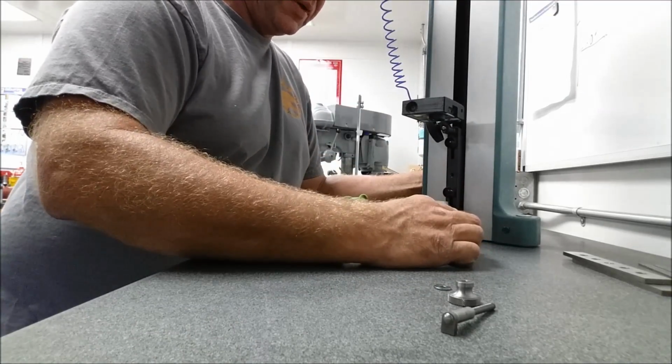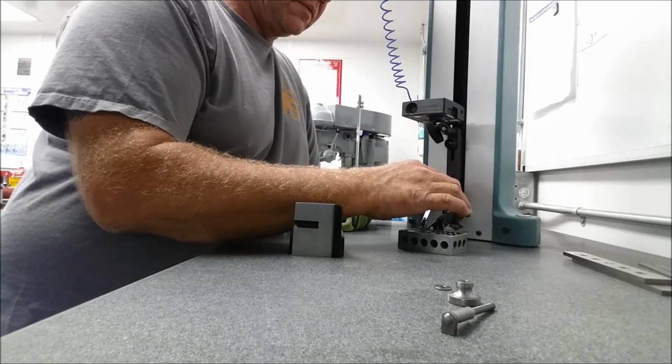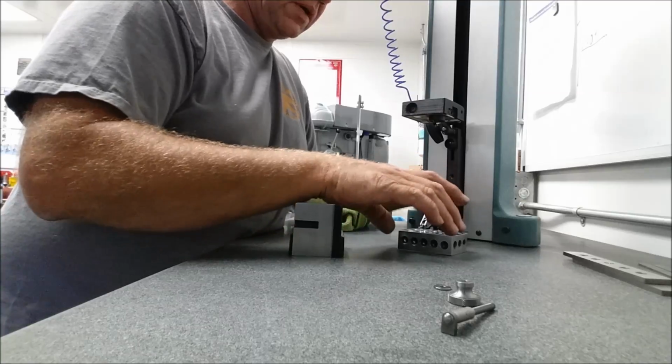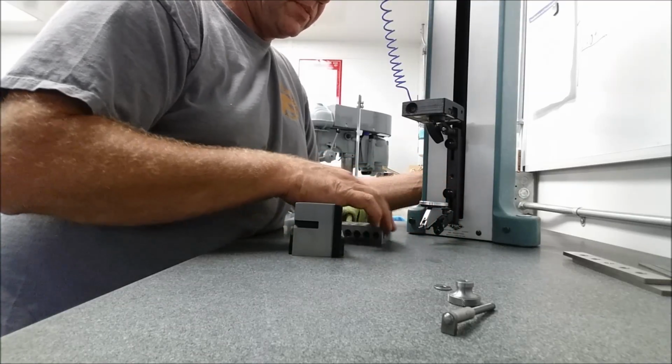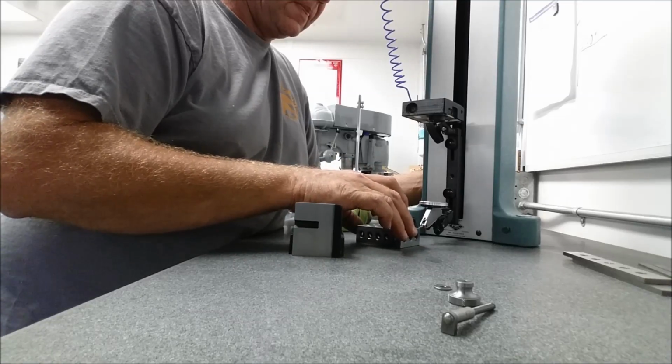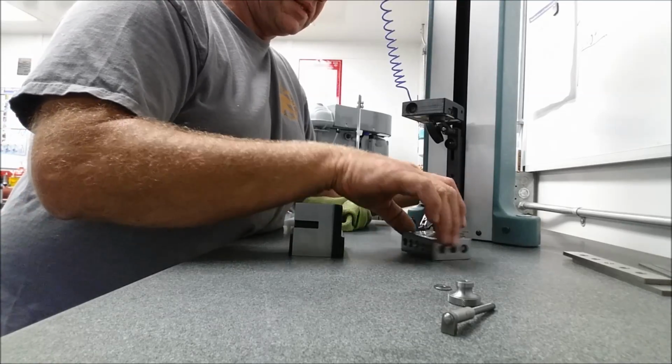I'm going to check these for parallel before we get carried away. Alright, so I'm pretty happy there. Back to 0. Okay, so that thing's within a tenth.